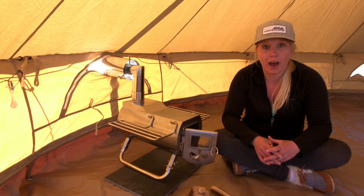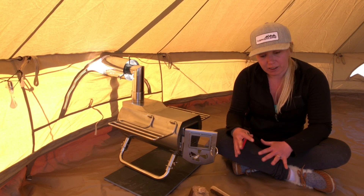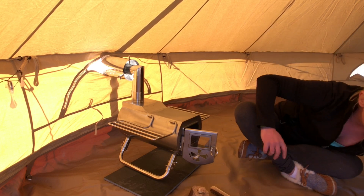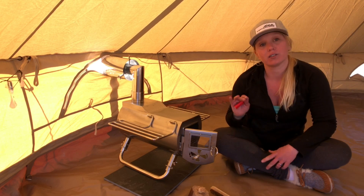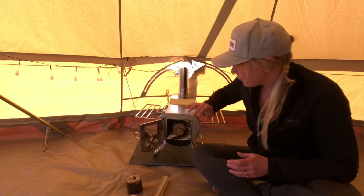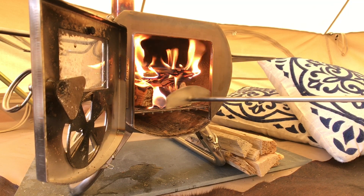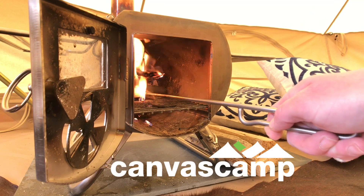Make sure that you have the ability to put it out if something goes wrong. We have everything ready and assembled to light our fire for the first time. Off camera, we also have a ton of water that I can spray using gravity directly into the firebox if, for whatever reason, we need to put out this fire. First, you want to start your fire in the front of the stove, and once it gets going, you'll push it to the back and then add additional fuel.